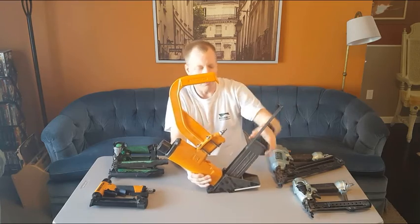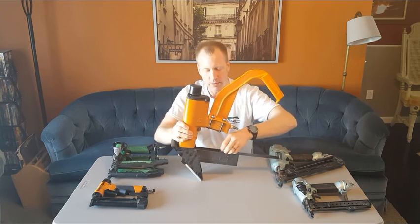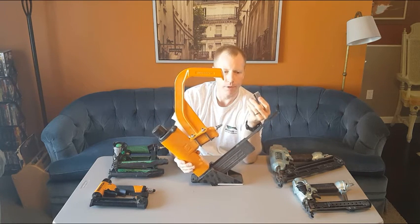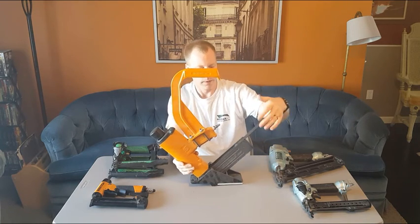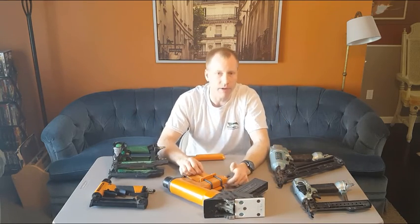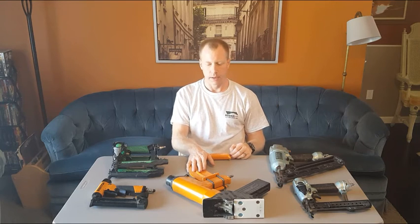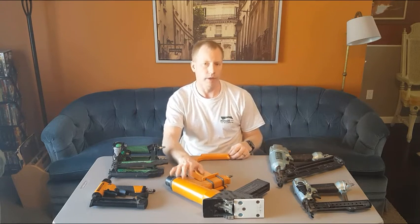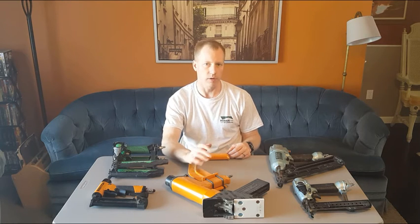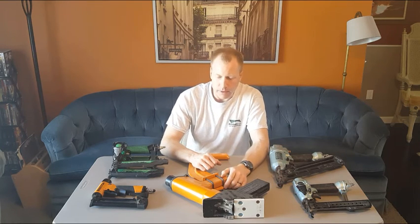You use a special rubber mallet to hit that knob, which drives the flooring tight and fires a staple. This is a pneumatic model — they also make brute-force versions where driving a plunger fires the staple. The staples are much larger than the quarter-inch crown stapler's. If you ever have to get the flooring out, it's a nightmare — I'd never attempt to save flooring installed with one of these, just break it out. Most people rent this gun rather than buy it since hardwood flooring installation is a one-time job.